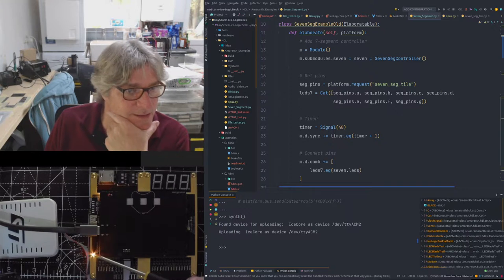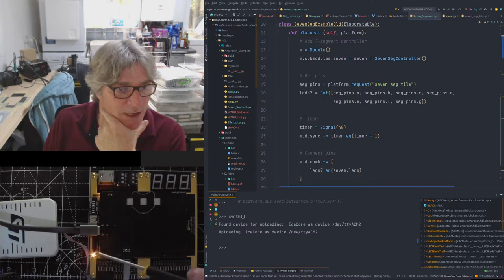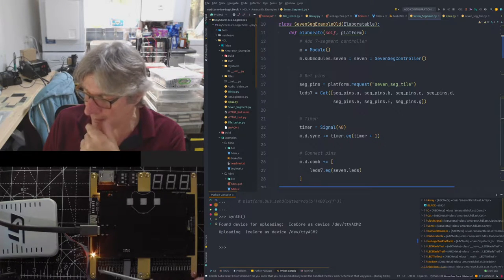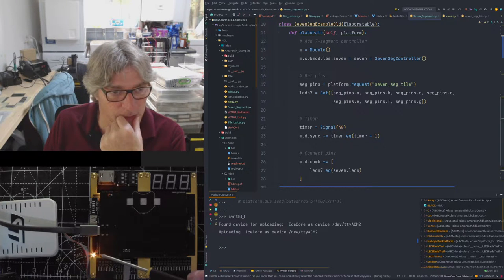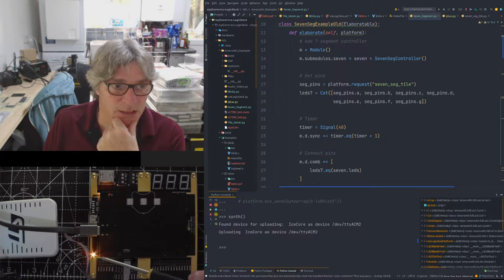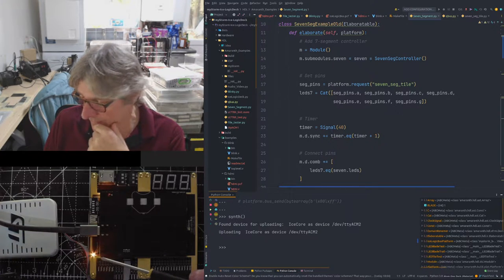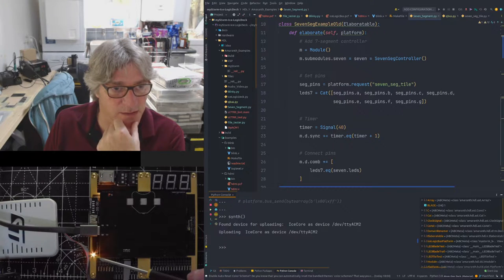This LED is on the IceLogicBus, and it's an RGB LED. By default, the red part of the LED is connected to the DONE pin. So obviously when it's not programmed like it is now, the red is engaged. Also the CS pin, I believe, is now connected to the green pin.